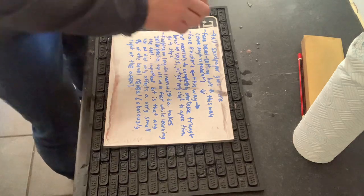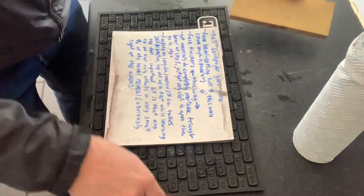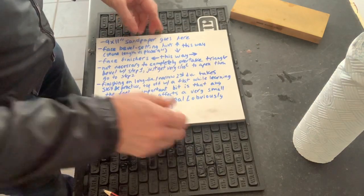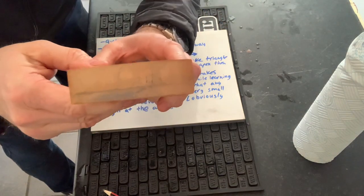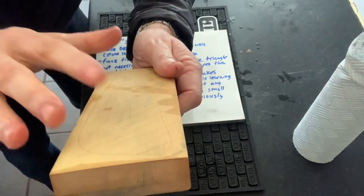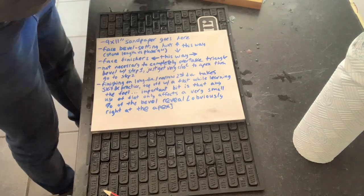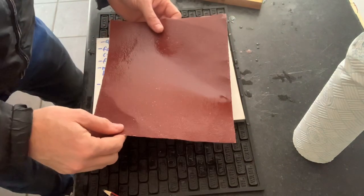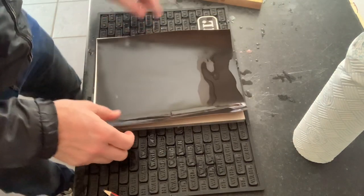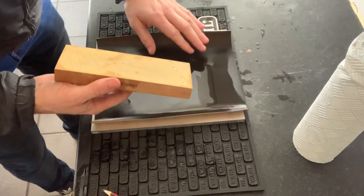Now we're going to do the 8K — mark it like so. We're going to use the longer axis, which is less convex. If you look in there you can see just a slight convex edge, and that side's flat. So you can still have a flat side. This started off on the 60 grit — I'm not going to start on that because I don't need to, but you will have to put the shape in for the very first time. So I'm going to go on to the 320 to clean this up for the purpose of the video.